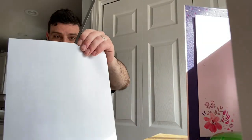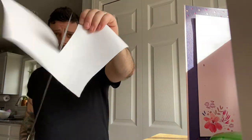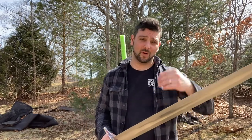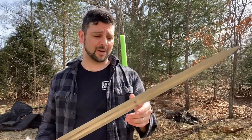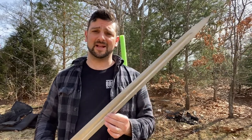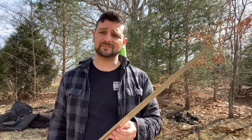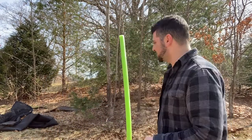Here is the edge after I sharpened it. You can get these blades both blunt or sharp depending on what you want to do. If you're going to do sparring, you want the blunt version; if you want to do cutting like I do, you want the sharp version. The sword did come sharp — I ordered it as such — however the edge was not really that good. You could easily run your hands along it and it didn't cut paper very well. So I went ahead and did my own edge on it. The edge geometry is actually very, very good on this sword, so I didn't have to do too much — I just honed it up with a 1000 grit belt. I'm going to test the sharpness on a pool noodle.